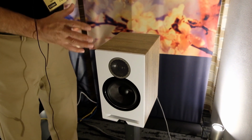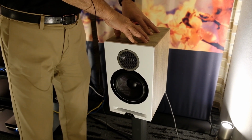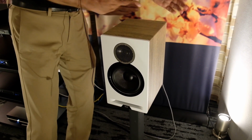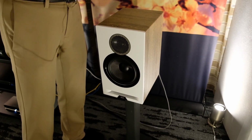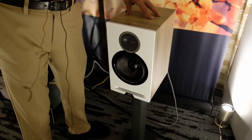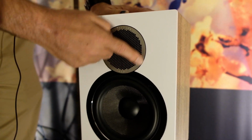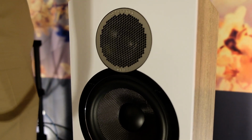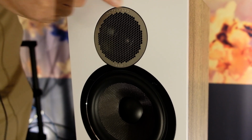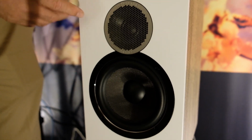Yeah. In terms of cabinet construction, it's a stronger cabinet construction. The walls are not as thin. We've got full perimeter bracing inside, essentially another baffle moved backwards halfway into the cabinet. So we've got full circumferential bracing. The tweeter is the same tweeter as Debut 2.0, but it's in a new waveguide, better optimized into the surface of the baffle, and also with a new grille. The wire mesh grille we had had some small anomalies around 15K and above. Right. This just has none. I can't tell the difference between grille on and grille off, even off axis. And it looks nice. Yeah.